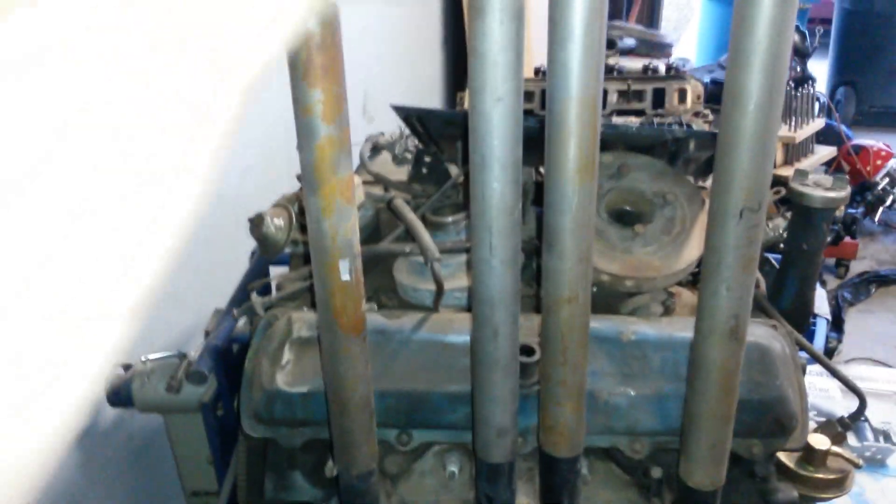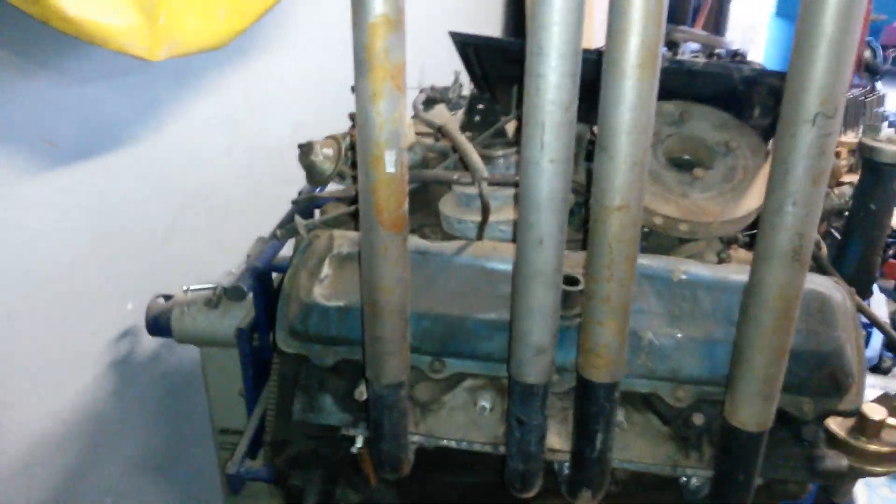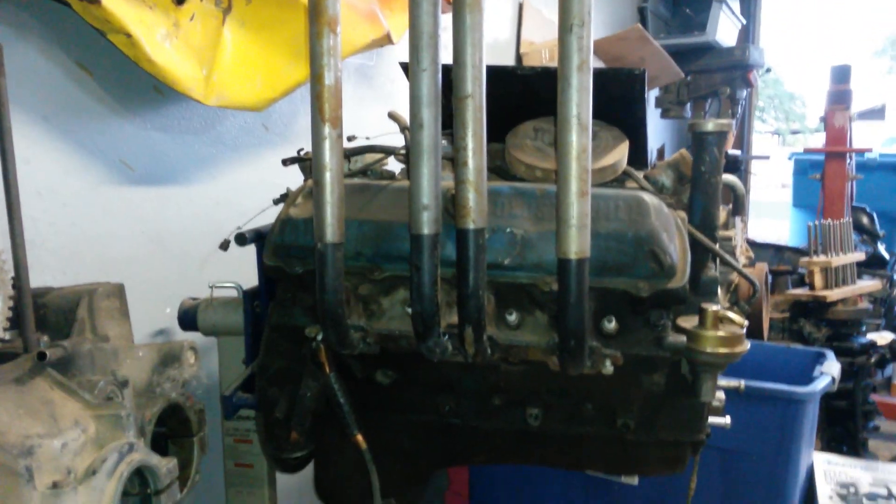Here you go - the tacked-up end result. They're tacked down here; I haven't done anything up here yet. My tubes are different sizes - I'll have to line them up a little better once I go to weld them and get them all the right length. I don't know what size tubes I got here - they're actually weird inner strut pieces from an ADZX. The earlier cars had homemade strut inserts that you could rebuild, but nobody wants to do that and they leaked like crazy. Down and dirty - demolition zoomies. They look pretty good from that side.